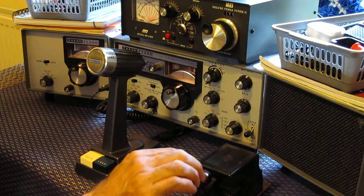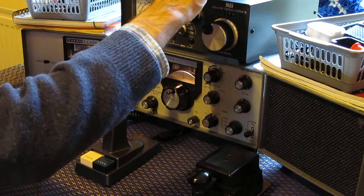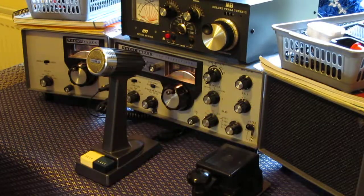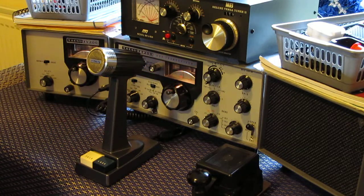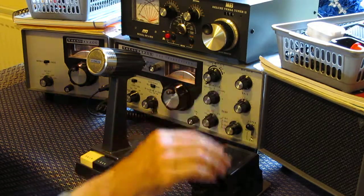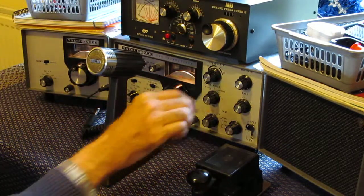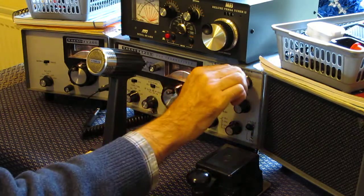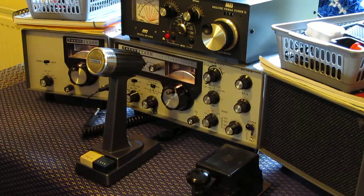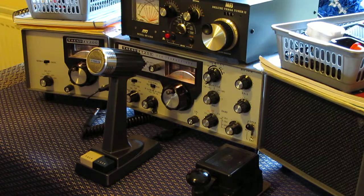Just to prove that the key actually works — put it on CW. That noise is because I've got the microphone plugged in; if you've got the microphone plugged in you get that kind of funny noise coming out of the radio itself. One thing you'll notice when you're using the filter is it kills your side tone — it knocks your side tone out. So you have to rely on that green light when you're sending.